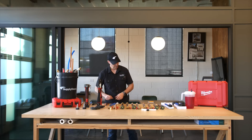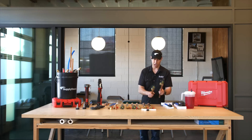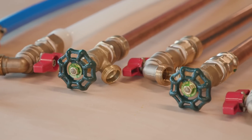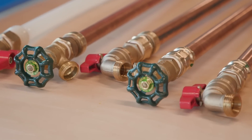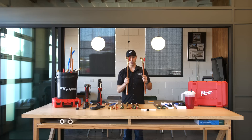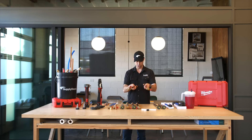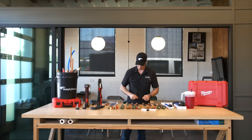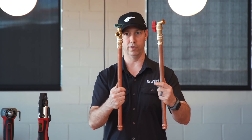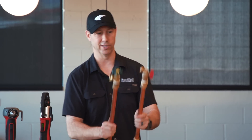Here's the setup. First off, we're going to test standard copper — both Type L and Type M — with sweat-on fittings. I put a gate valve, basically a hose bib, on these so that I can make sure I filled these all the way to the top with no air bubbles. Next, I've got a JW import press fitting, also available at SupplyHouse.com, and again I've got it in Type L and Type M so we can see if there's any difference on wall thickness. The next pair is Viega — the brand name, the more expensive of the two — and again I've got it in the thicker and the thinner wall. And then for fun, I put some SharkBites on there, so this is the thick and the thin wall with a SharkBite.